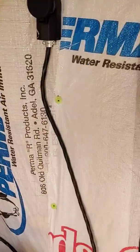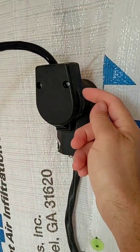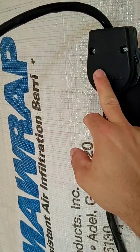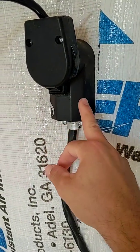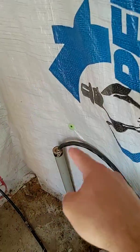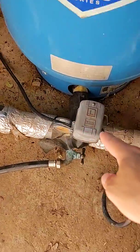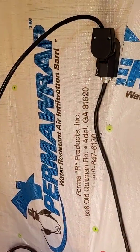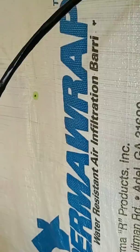So now when my power goes out, all I do is simply pull this out and plug it into my generator. What's important is make sure that the plug you have fits into your generator. So what I did is I made sure that my male plug fit into my generator, and then I bought a female plug to match that. So when your power is working, everything is cool. When your power is out, you just unplug this and plug it into your generator.